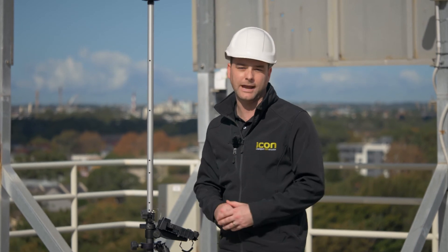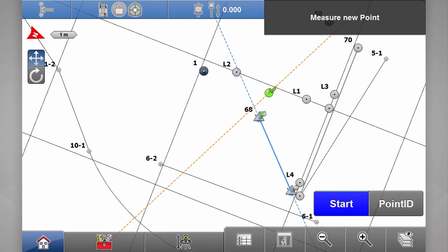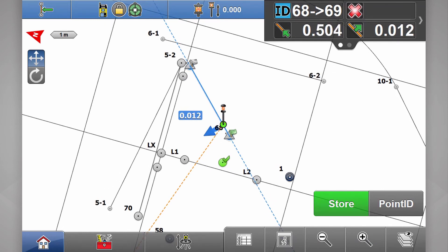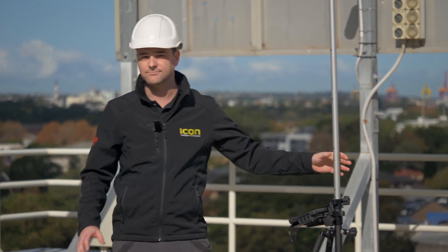Now secondly, I wanted to do the cable tray. So I select my app layout lines. Once again, instructions in the top right hand corner: select a line or arc to stake out. I select my line, hit start and off we go. You'll notice here that we've got some green and checkered flags. These help you know how far along the line you are. Right now I can see I am 508 mil along the line and about 11 mil offset. Once we level up and refine our location a little bit, we're ready to either start marking with a pen or just spray painting a line. Nice and easy — now you're ready to get stuck in.